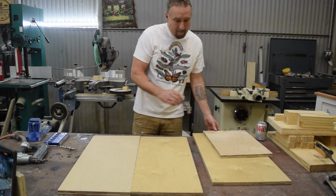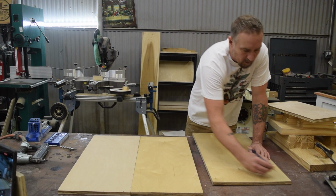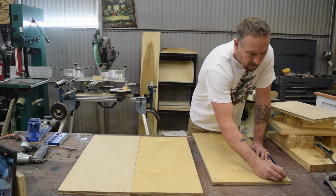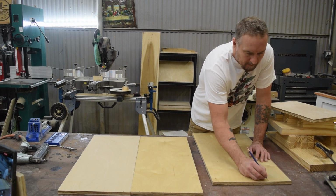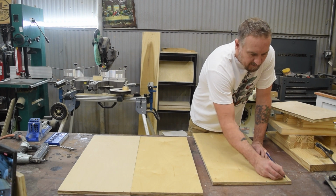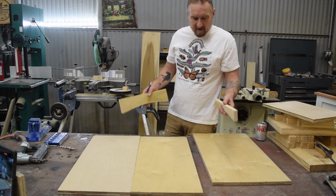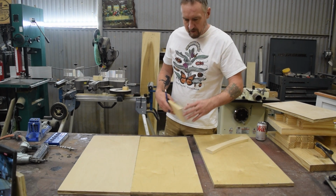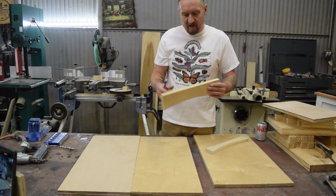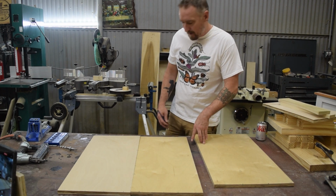And then in the back I'm also going to put 4 pocket holes, and I'm going to do these on the back side. No, you know what? I think I'll do these on the inside, because we're going to have this piece of trim. This is a very small bookcase, and we're going to have this piece of trim in the front underneath the top, so it's going to block you from seeing those pocket holes from the inside. So I'll go ahead and do that.